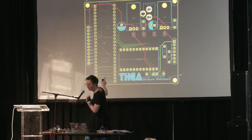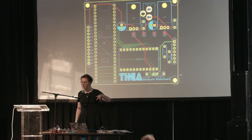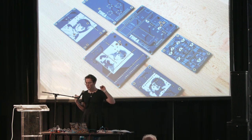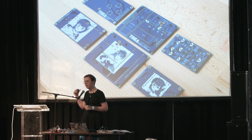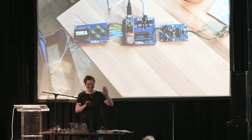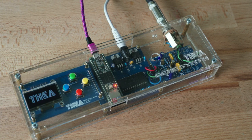This is what one of the PCBs looks like for the synth in KiCad — this is the motherboard. On the side is the Teensy, in the middle is the YM2612, and at the top are the two voltage regulators. Here are all three PCBs fresh from the manufacturer — the display board, the motherboard, and the audio board. I actually designed the audio board first, because I have no sense — it's the most complicated one. And then you just put it all together, and it actually did work the first time. Legitimately the only thing that went right in this project. So I laser cut a nice acrylic case for it, and now it's a beautiful synthesizer.